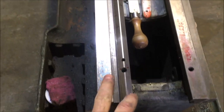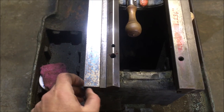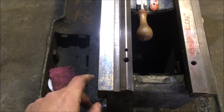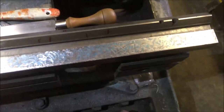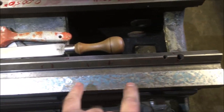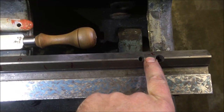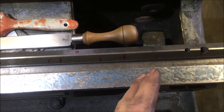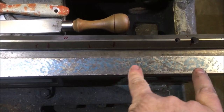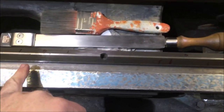The reason being that the foot on my spirit level is trying to balance on the extreme edges of this surface, which is not giving me a true reading. It was all over the shop. Anyway, putting it on the 1-2-3 blocks, and then setting basically one on the end here and one here. So my starting position is, the bubble is 2 full stops short of perfectly true, perfectly flat level, I should say. And then shuffling the thing along so that foot then moves into this position and take the next reading.